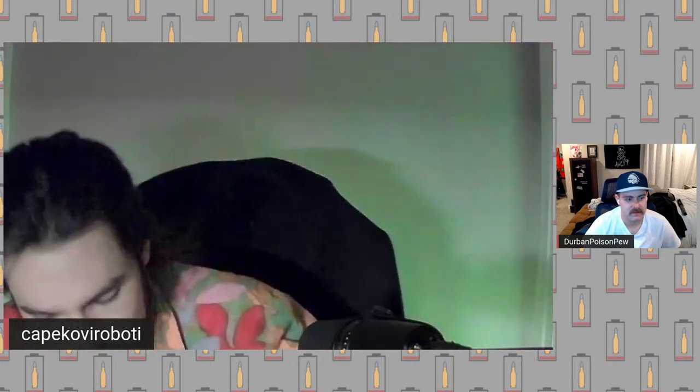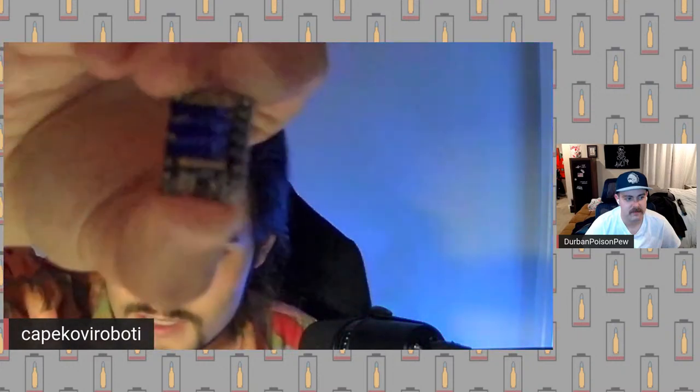so that you can grab little stepper drivers like this and actually insert them into the board. And so if you're doing that, like we just inserted one, you need to pay very conscious attention to what stepper drivers you used and set them in the firmware. And we'll talk about this in a bit.